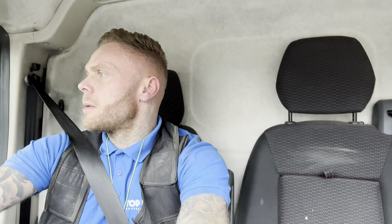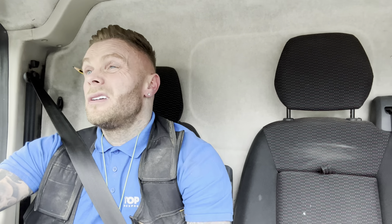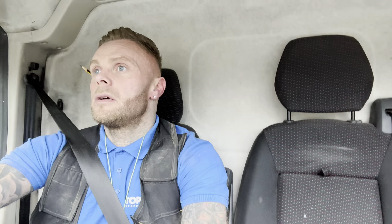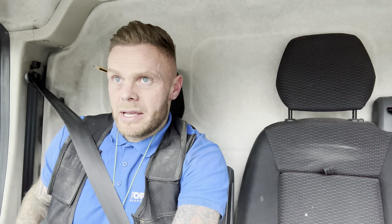We've ended up going back to water-based as a bulk. There are certain things we do use PU for now and then, but for health reasons and easy cleaning up of the system, since it's not our main trade, water-based works best. We were buying from Symphony Coatings - they do offer good products. We then tried Movac, cheaper than the others, but I found their paint was a lot thinner and didn't go on as nicely. We now buy from Renner - the primer from Renner is so much thicker, just goes on so much better. You pay a bit extra but you're not putting on as many coats, and it's a more durable finish. So we stick with Renner now.